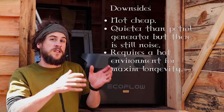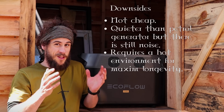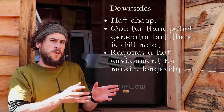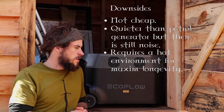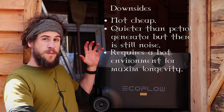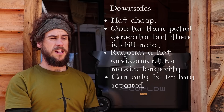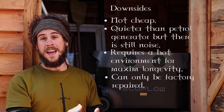You could get around the noise issue if you stored it in some sort of soundproof cupboard. Another thing to consider is optimal operating temperature — these sorts of batteries don't like getting too cold. The EcoFlow website says it can function in extremes of minus 10 degrees Celsius, however they recommend it should be used and stored at plus 20 to 30 degrees Celsius for maximum longevity. To be honest, I'm lucky if I can get my house in that temperature range in the height of summer, never mind my van or shed. Perhaps you could get around this by creating a storage cupboard with a small heat source and thermostat that would also keep the sound in and maintain that optimal temperature. And finally, like I said in my previous video about the Delta Max, these batteries fit the keep-it-simple principle for everyday use, but if this thing breaks there's no other option but to send it back to the factory — whereas with a petrol generator, even though it's noisy and has horrible fumes, at the very least if it breaks I could take it to a local mechanic to get fixed.